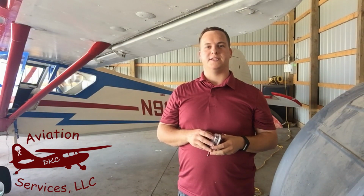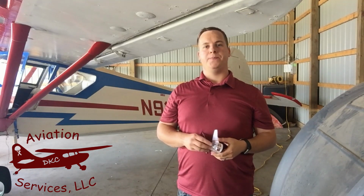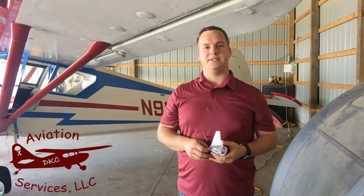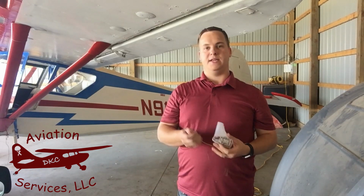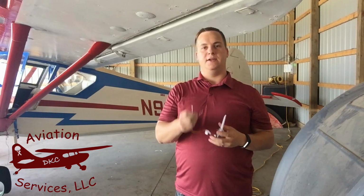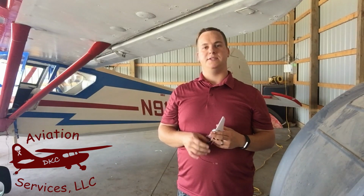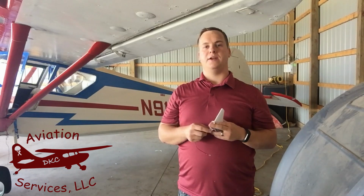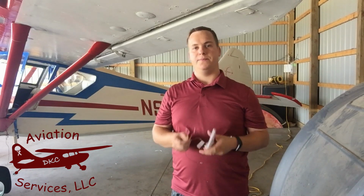Folks, we're out here at the hangar. We're going to get working on the skyBeacon install today. I did do a little bit of prep work while we were waiting for the skyBeacon to come in. I had pulled the original nav light off to see how it connected. It had these handy little handshake connectors on it. So I've got a couple of those already crimped onto the skyBeacon. With some shrink tube over that, we'll put over the connection once it's made to keep any moisture out.